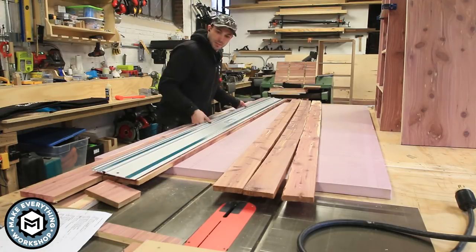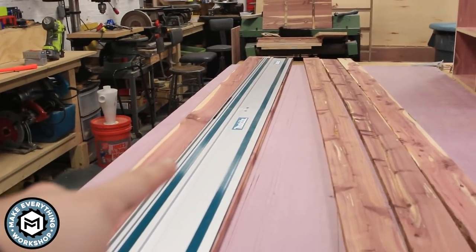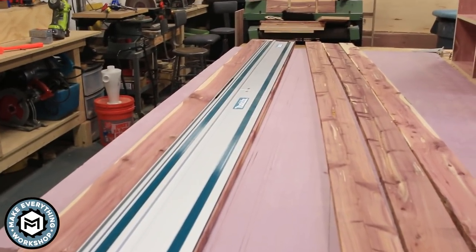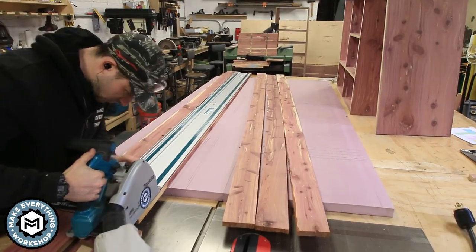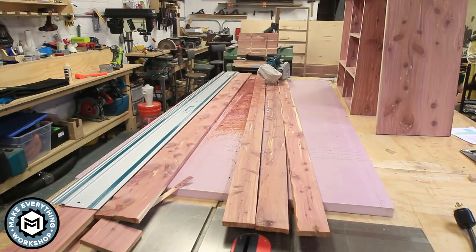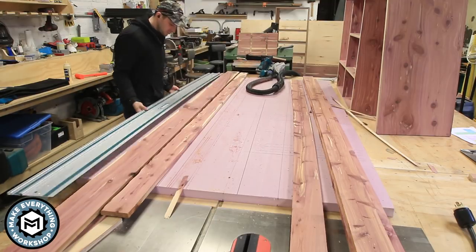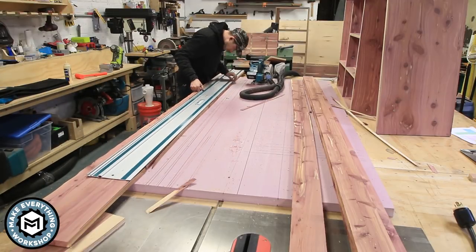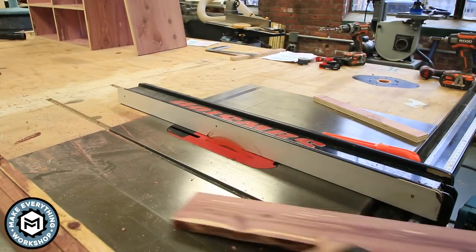I bought four-quarter rough-cut cedar from my lumberyard where I got the cedar veneer plywood. It took a lot of cleaning up to make it usable - the selection wasn't so great. I used the track saw to square up these boards, giving me a nice reference edge for ripping on the table saw - the track saw gives a perfectly straight cut and minimizes waste, essentially acting as a jointer here. There was a good amount of waste from pieces that were totally blown out and full of knots. With the track saw I cleaned it up and then ripped down my nosings and all other solid wood material.